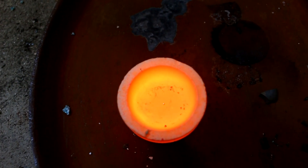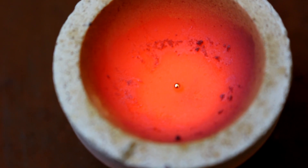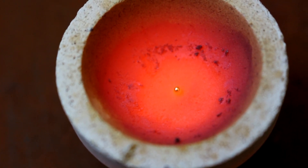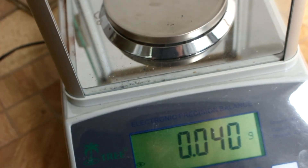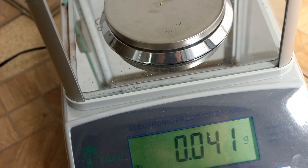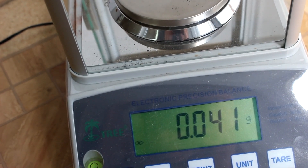Now that's more like it — I can see there's a bead of gold there. Once this cools off we'll weigh it and see how much we recovered. It's probably almost pure gold, and there it is — just solidified, and I love watching that. Here's the bead of gold collected from the two kilograms of material — let's put it on the scale. It weighs 40 milligrams. I was expecting roughly 50 to 60 milligrams, so I'd say I extracted most of the gold. Excellent — hope you all enjoyed, and I'll see you next time.